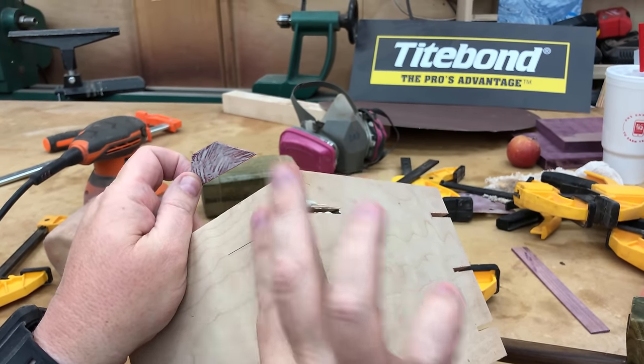I think we did two trials and on the third one it happened to fit perfectly. You should never have to take more than maybe three or four trials to get it dialed in. Our test fit looks pretty good — in fact it should be a tiny bit loose so that when we get glue on there it still fits. Next we want to take it over to the table saw and cut off that bit of dovetail at the bottom there. We can cut it a little wider than what we actually need — we're going to trim the excess off anyway once the glue is dried. Some ended up a little wider and some a little narrower — the dovetail keys are a little finicky, a little hard to get started even though they fit, so you do have to wiggle around just a little bit to get it to slide in nicely.